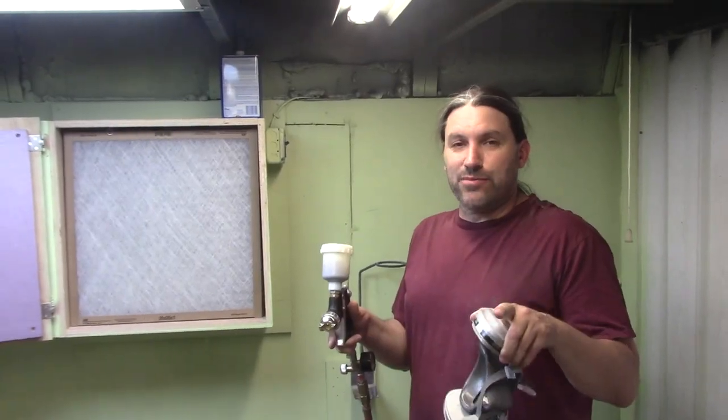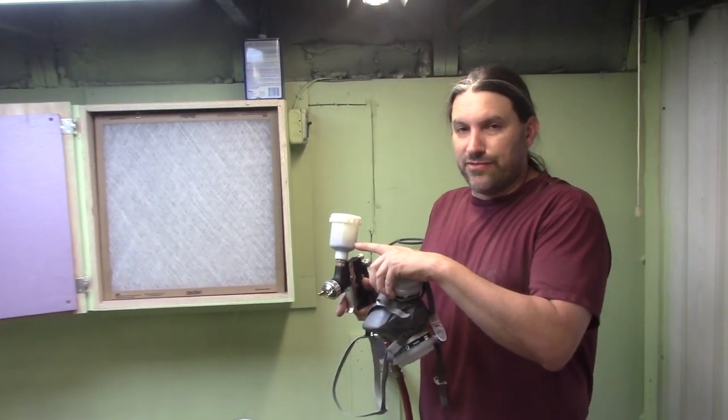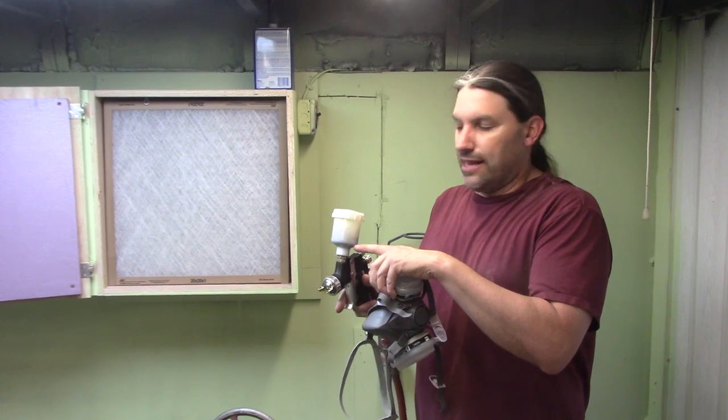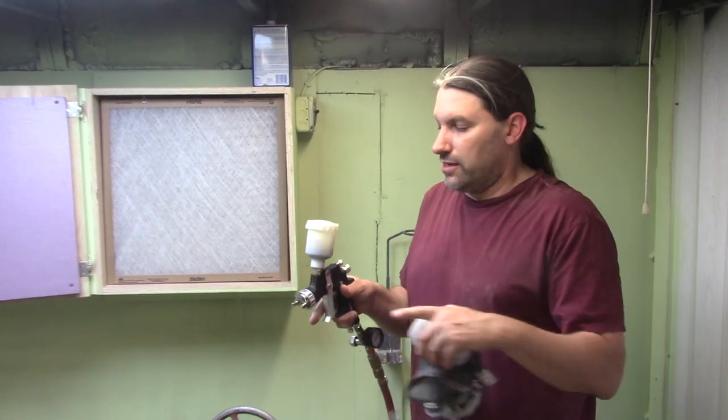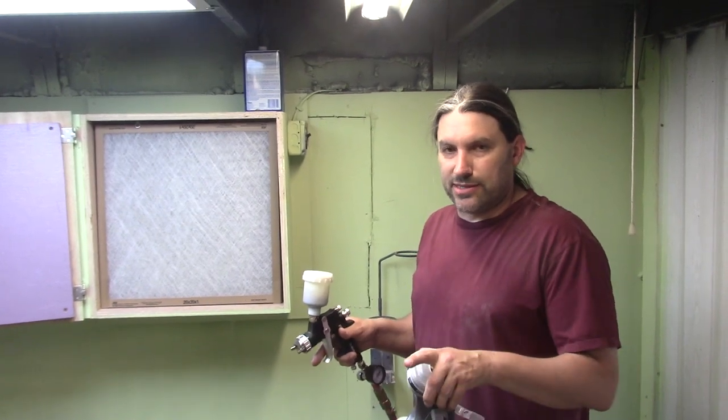Okay, so we got our amber shot on the body, which you just saw. Now we got our tobacco brown DBC 500 mixed with the same aniline dye that we used before, only a different color. And it's in the gun, it's ready to go. Chris got me all sorted out on the adjustment. We're ready to sunburst. Let's do that now.